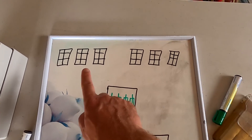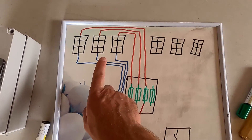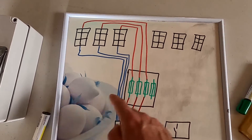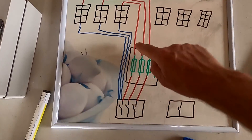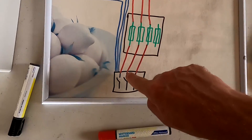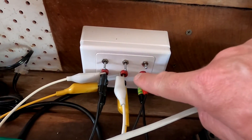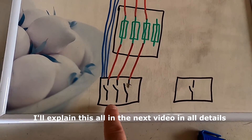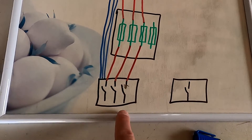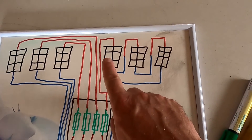That's why I have four fuses for six panels. The first three panels I will cable in parallel — the positive and negative come into the garage separately. The positive goes through the fuse box and then down to a terminal with several outlets for the solar panels. I'll have a terminal down here with switches and an XT60 connector at the bottom where I can connect my solar charge controllers for testing. So the first three panels run all in parallel.